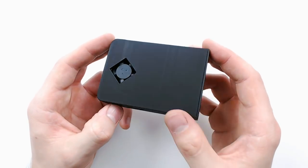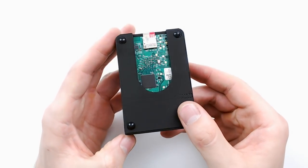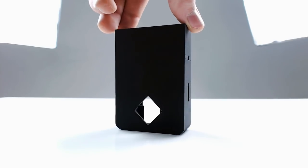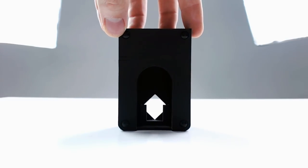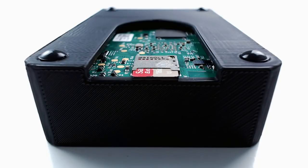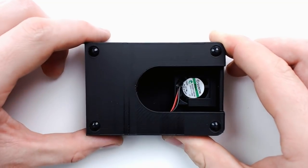Like the other designs I've done, this basically takes a modified Raspberry Pi 3 and adds a handful of features to make it more suited to running as a server. The case is mostly made from a single 3D printed piece and the final thing is actually a bit smaller than a regular Pi case. On top there's a built-in fan which connects directly to the 5V and ground GPIO pins. Underneath, the case is open, which allows access to the micro SD card and also makes heat dissipation easier. The opening also makes it less fiddly to install the fan, which just slides in place.